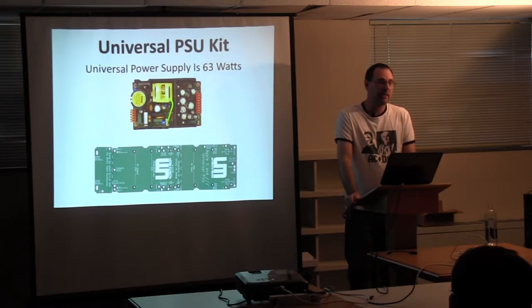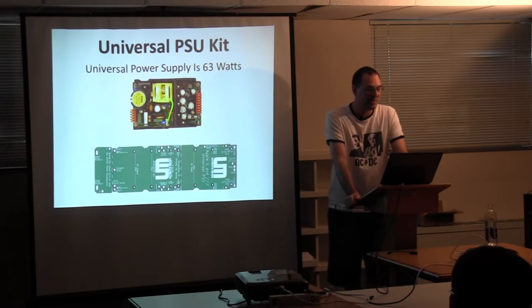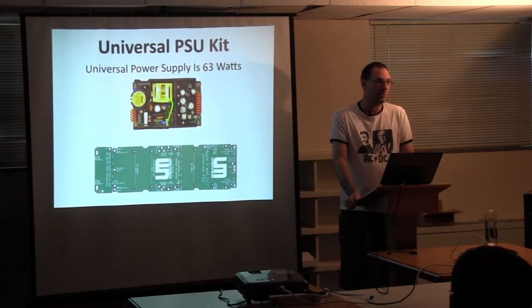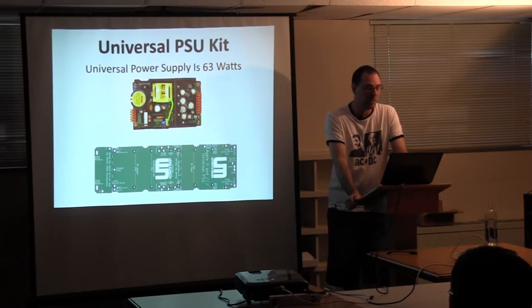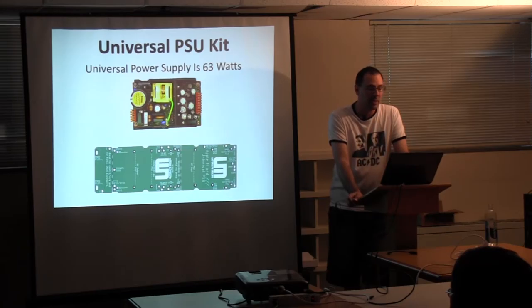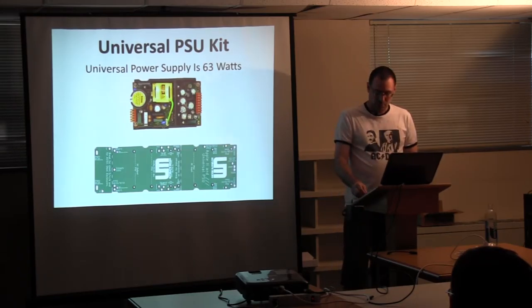The kit itself is also insanely easy to install — it takes about 15 minutes. There are no modifications to your enclosure or your chassis. It's good for at least another 10 years of use. I recommend every 10 years, regardless of how much you've had it on — 5 minutes or 10 years straight — replace the power supply. It's just good insurance. They're relatively inexpensive — it's about 10 bucks a year for a little peace of mind. These are also medical grade power supplies, used in heart and lung machines and all kinds of monitors. They're meant to take abuse. They're meant to operate in heavy humidity, in environments of ambulances and things like that. This power supply design is actually closer to 12 years old now, and it's in revision Q — which gives you an idea of how old and how well designed it is. All the issues have been worked out.